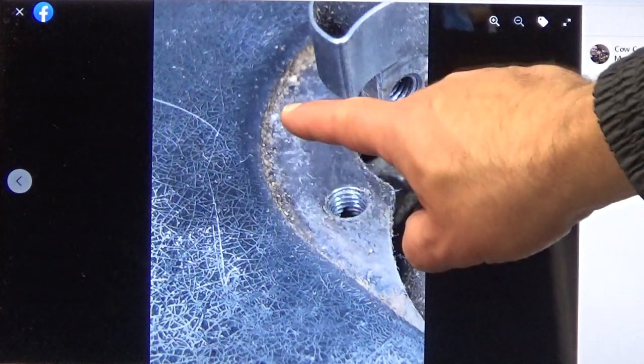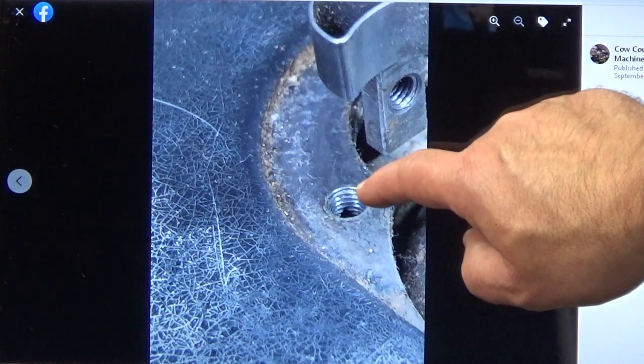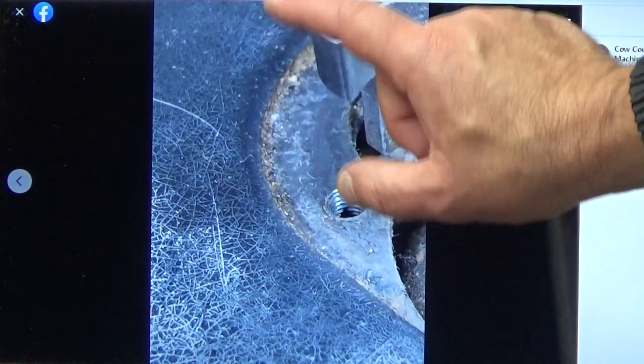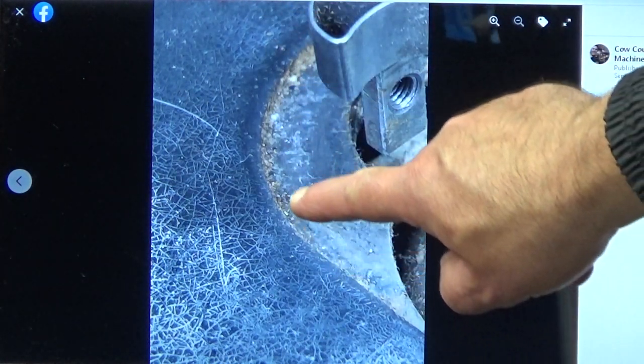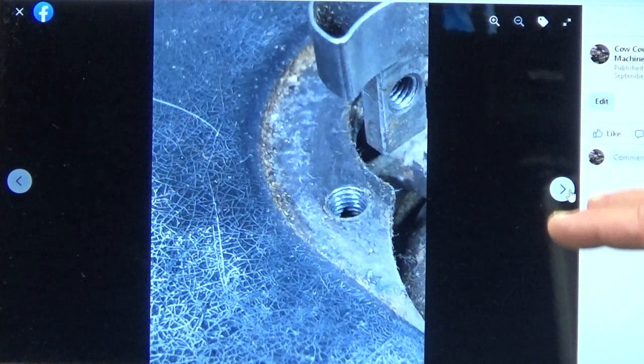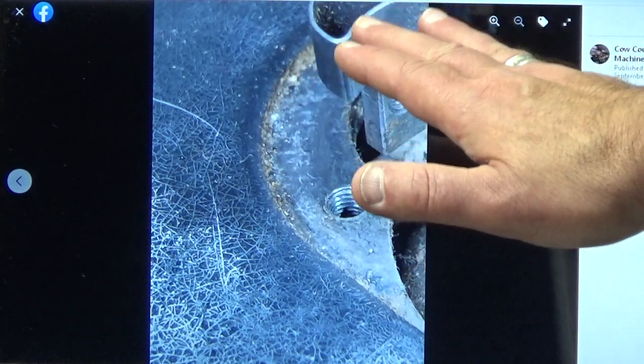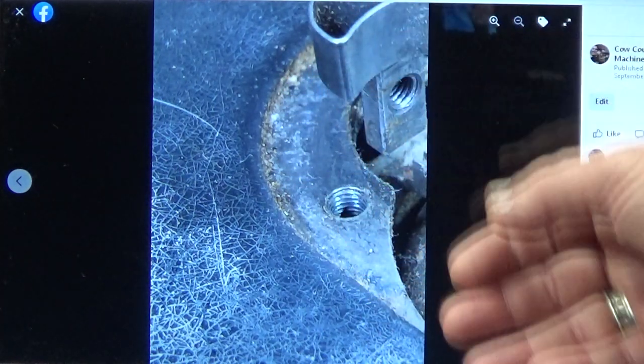And here we're looking near the raceway again. Remember we talking about that plate that goes over the feed dogs, and it goes over the throat plate, the one right here that kind of sets down there? Look at all the buildup on the edges. And again, that plate is not going to seat down properly if all of that isn't removed, so that it's all the way down and you're getting the full benefit of the feed dogs.